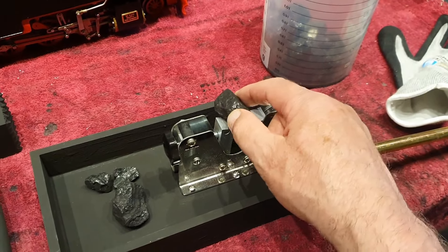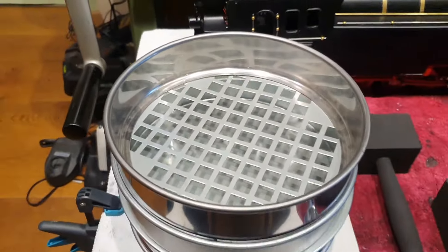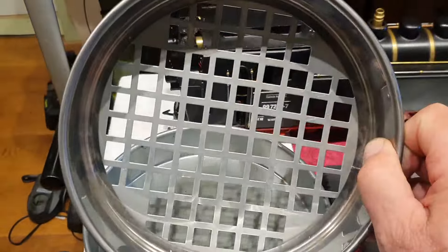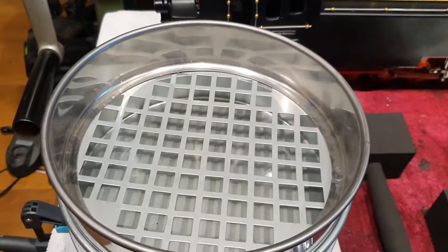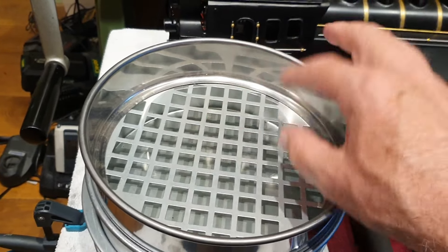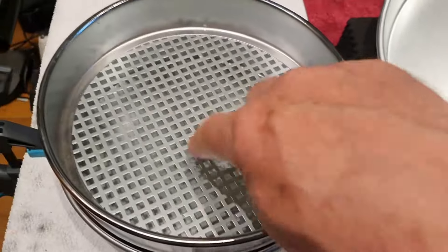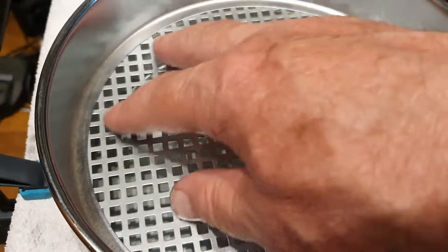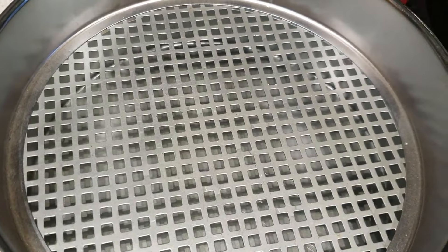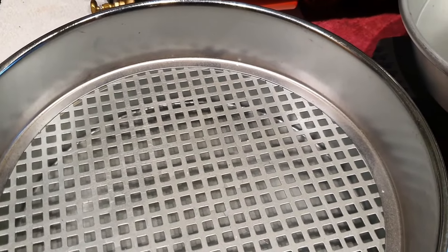I put the coal pieces in between and crack them into smaller pieces. Then with a shovel I bring them to a 12 millimeter grid with a collecting pan underneath, which separates the bigger parts from the parts smaller than 12 millimeters. After that I add them to a second grid of about four millimeters to separate the smaller dust particles. The parts left in the upper section of that grid are between 4 and 12 millimeters — the right size to fire the locomotive.